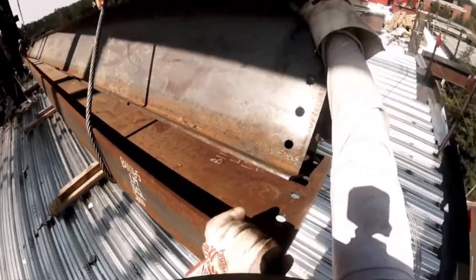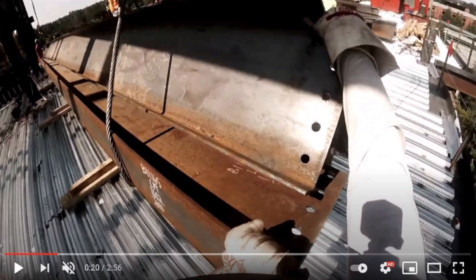So right now I'm already grabbing it, right? My hand isn't in a bad spot here. My right hand over here is not in a bad spot because there's no other iron over there that could clap it. This hand's a little bit on the sketchy side because this could slide down here. But since it's already set, this choker, this basket is already set and it's strong. So it's not necessarily just going to randomly clap. I mean, when you shake out, stuff happens really fast and the iron's very hard to manipulate, especially in a basket. So this isn't really good practice where my hand is over here. So I don't recommend that.